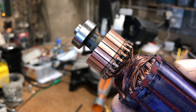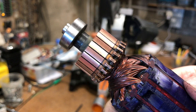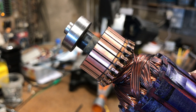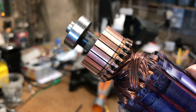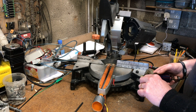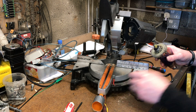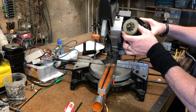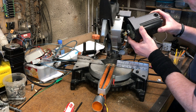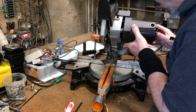There you go — that's the armature all cleaned up. I'll give the segments a little wash and brush out with IPA, just in case there's any debris from the lathe work. Hopefully it'll go back together as well as it came apart. Just going to put a spot of grease on here — there's some already in the gearbox but a little squirt more won't hurt. I haven't had to disconnect any cables — just about managed to do it without that, which has saved some time.